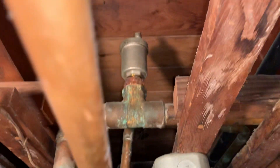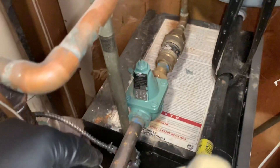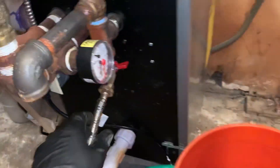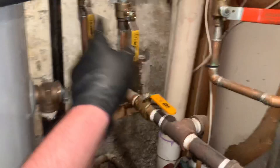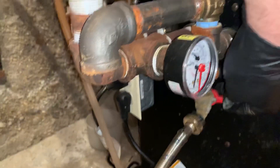I'm just going to loosen that up a little bit. I've got the boiler feed valve closed. I have a five-gallon bucket ready. I'm not going to turn off any of the zones because of the check valves in here — there will still be water above. I'm just going to bring down the pressure.